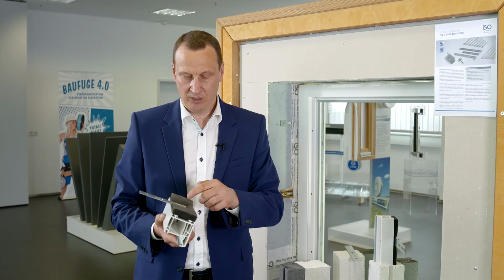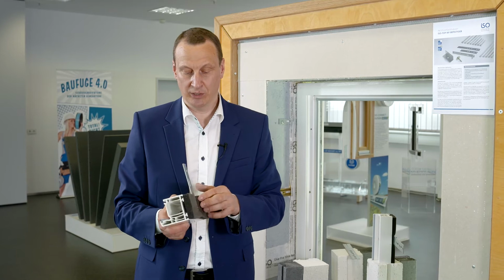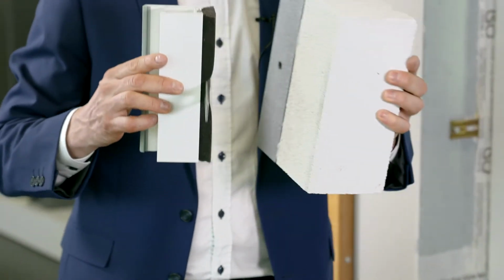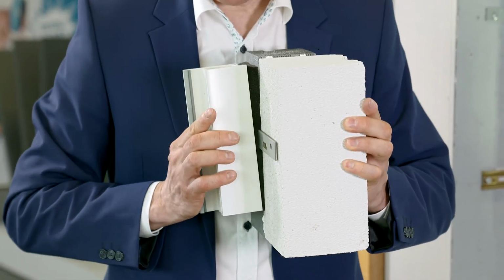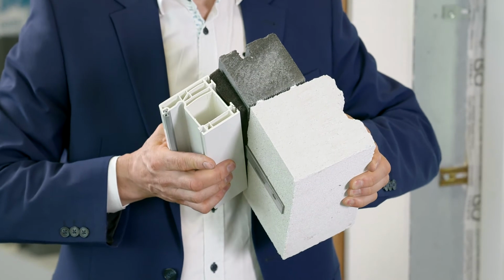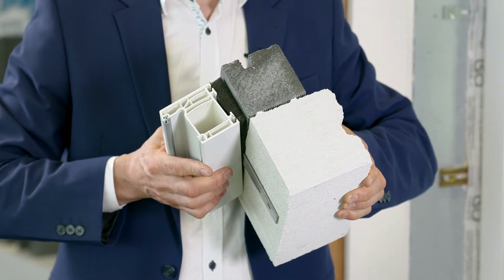Again, the multifunction tape is attached first, then the anchor is drilled, the multifunctional tape is drilled through as required, the anchor is fitted, then the window is placed in the window reveal with the anchor. And you can see that the anchor lies flat against the window reveal, and when I screw the tie plate in position, I do not damage the airtightness level in that area. And the window can be fixed in place with fall protection. ISO-Top JUSTA ETB Anchor BA.